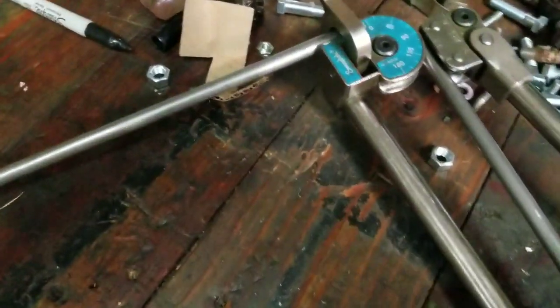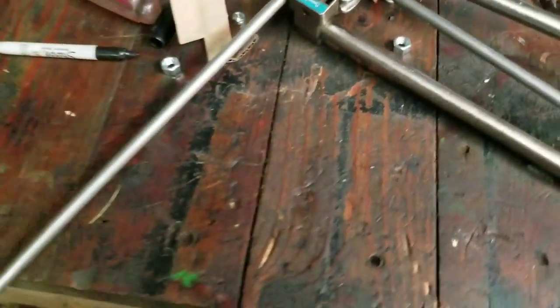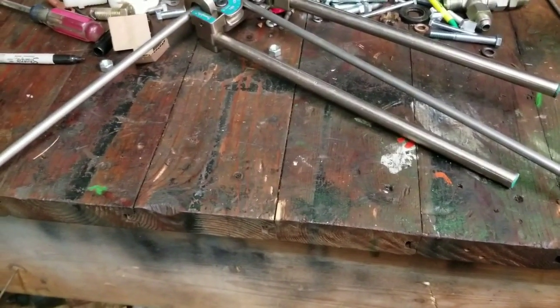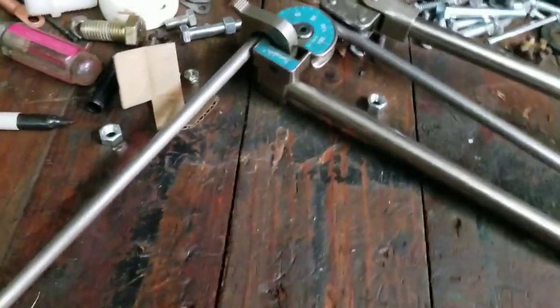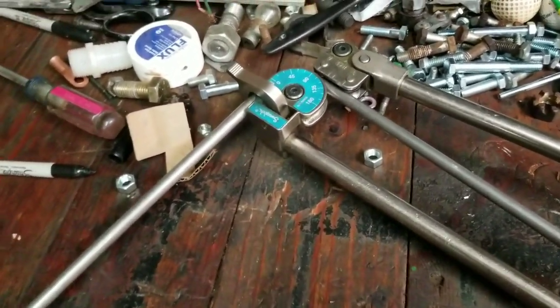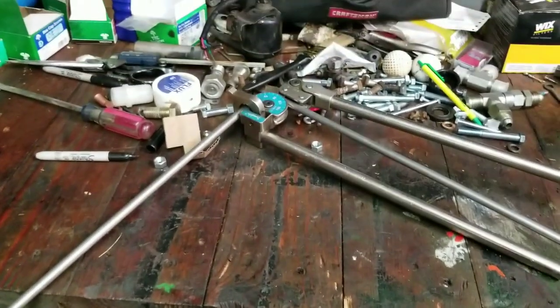Here's the bender. I don't think it's made by Swagelok, but Swagelok manufactures fittings, so they had this bender made. I think the salesman sold us that thing. This is just 3/8 steel hydraulic tubing — I think the wall thickness is 0.065. That's what we use basically for most of your steel lines on hydraulic systems. I've got tools here I can cut and flare it, so we put JIC fittings on the ends. Anyway, a couple more bends here and I'll get it up to that panel.